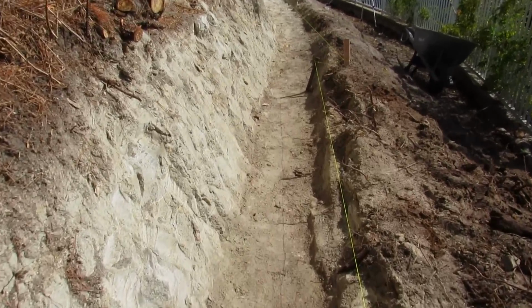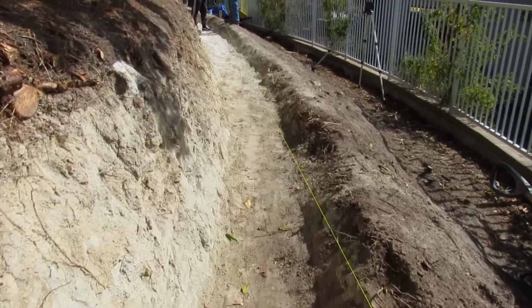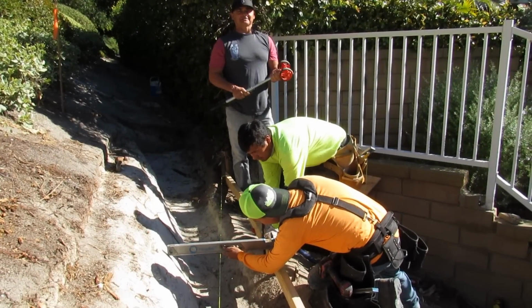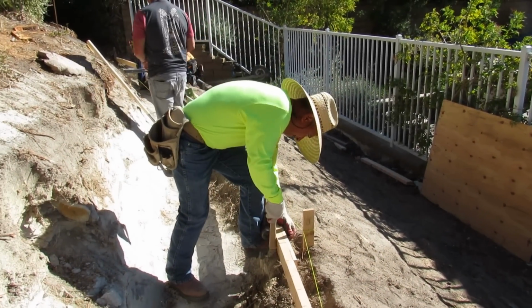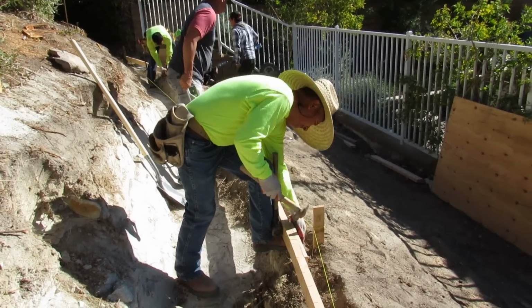All the water is coming off the hill, running into these people's backyards for about 20 years. So the county made the homeowners association put a J ditch in, and then I got to do 60 feet of curb and gutter out front in the city sidewalk and put a steel storm drain in it. Here's me and Milton and his son setting it up. We had it surveyed, and the surveyors put the elevations for the outside of it, so we had the elevations.